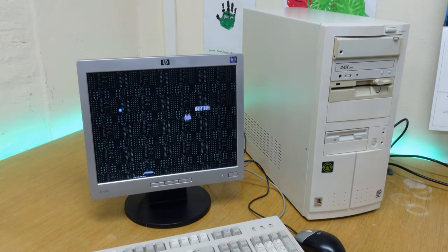Welcome to another video involving the barn-find Pentium Pro machine. If you're unaware of this machine from my other videos, this is one I found in a shed in New Delhi. After a lot of cleaning up I got it working, but there's an issue with the motherboard: the IDE channels are not working, the ISA slots are not working, and the processor speed is being misrepresented — it should be running at 150 MHz but it's actually coming in at 120 MHz.